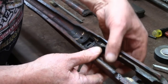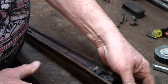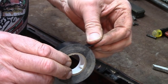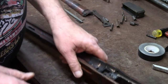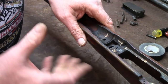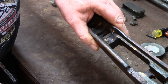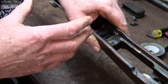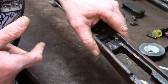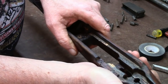I'm going to splay this as gently as I can, work the glue down inside those cracks, and then use vinyl electrical tape. Vinyl electrical tape has a good stretch to it, which provides an extremely good means of clamping wood surfaces together — as I wrap it around, it provides a good solid but flexible clamping. Clamping with a mechanical clamp can sometimes overstress the glue joint and starve it — all the glue disappears and you have a weak joint. With tape, it allows the joint to squeeze gently, as if squeezed by a hand, until the glue dries without being too aggressive.